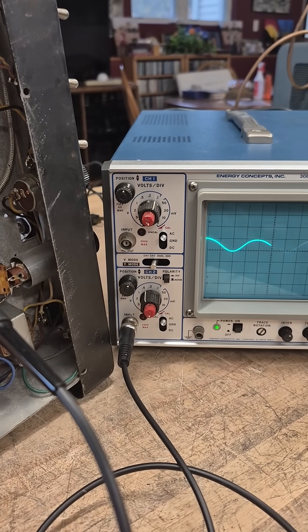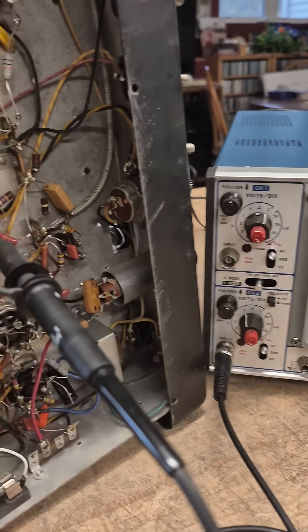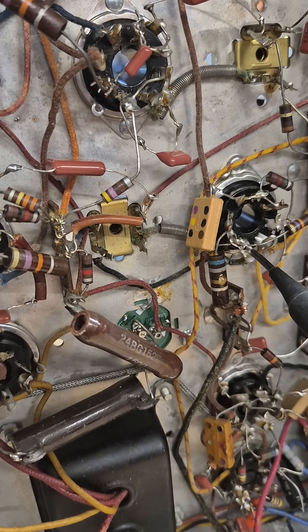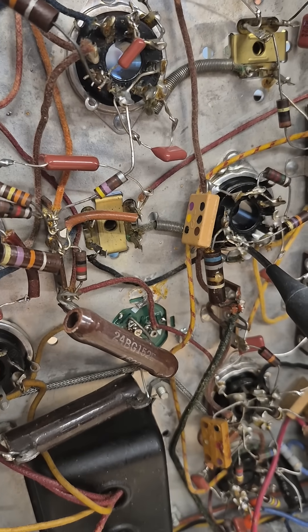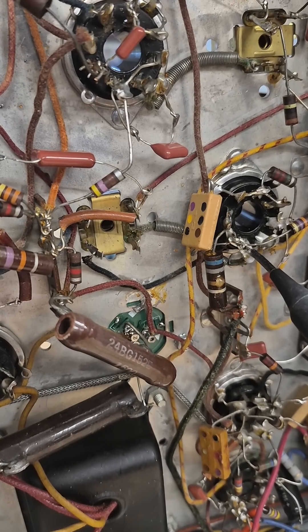See that? My guess is we've got a little bit of silver mica disease, but it's an internal cap inside of the IF can. The only way I'm going to find it is to disassemble it and repair that.